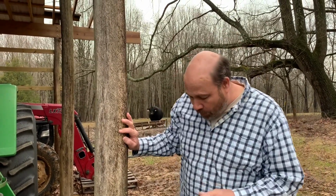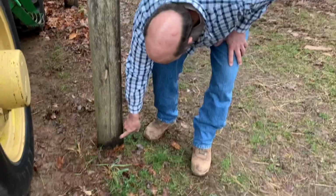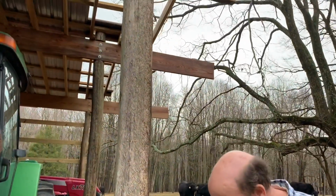But what I did on the pole is I took some roofing cement, what you can see here, and some gasoline, and I mixed it real thin and I painted it on there, but it's not good enough. And what I have in the house is, when I went to that farm show up in York County, Pennsylvania a couple weeks ago, I came across a company that can sell you, I don't know exactly what it is, I gotta call them yet, something that you put on there and you wrap it. So I'll have to dig down so deep because it's rotting a little too much. I don't know, it probably would last a long time, but after you put all the money in it, the roof and all, you don't want none of your poles rotting.